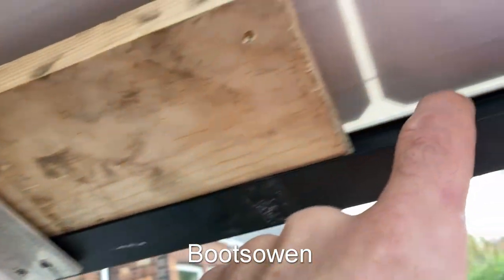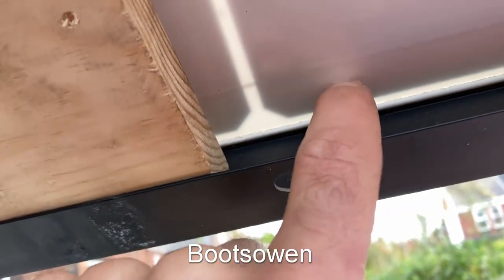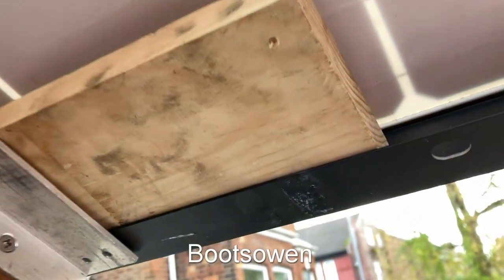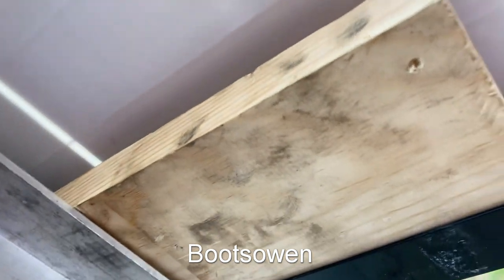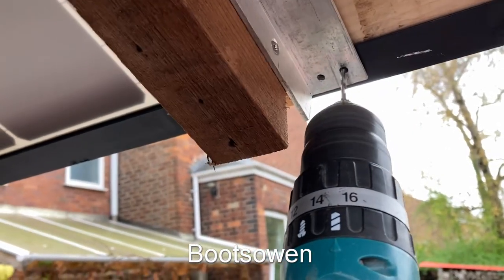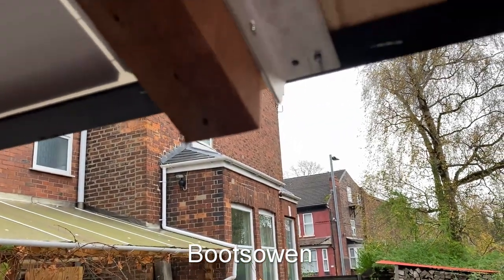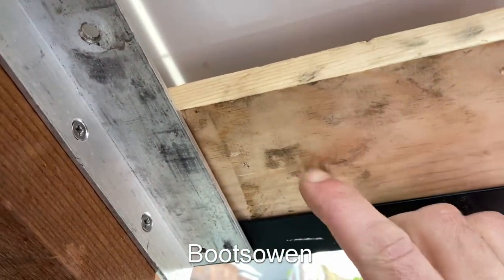But you're drilling through this aluminium, which is quite thin, a mill or two. And on the other side is this glass with the solar wafers right behind it. Like you could feel them with your finger. There's just a layer of plastic. You don't want to damage them, you know? So I've put in a little block of timber that slides in. And when I'm drilling, I'll quit now before I go through. But when I'm drilling anyways, because I'm holding this with my hand, it'll go to the timber before it goes to the plastic.